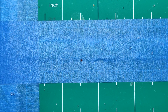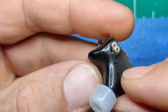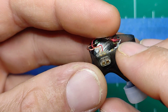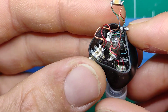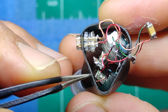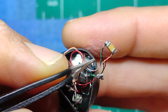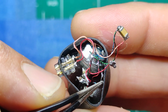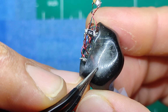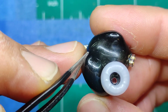You can kind of see I do my own IEMs, and I started getting into it. So this is 3D printed resin. You can see I started working with the 2-pin connectors. These aren't finished, but I had to do this all by hand. Same exact process. Took a mold, poured the resin in the mold, I cured it. This is what I came out with. My layer is really thin. I need to thicken it up a little bit. There are some imperfections, but basically after I'm done assembling them, I sand them down, and then I coat them with a coating of lacquer.